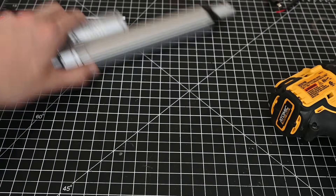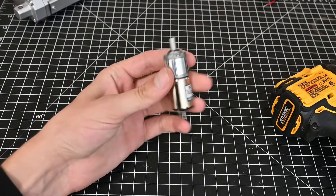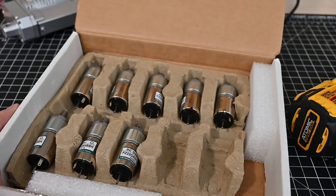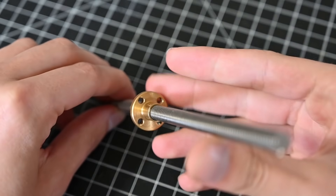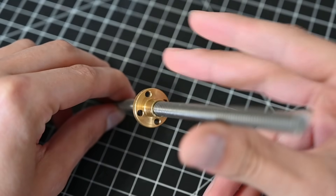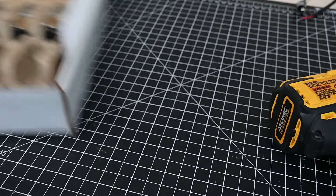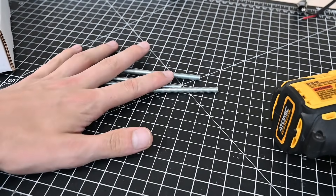Let's see if we can make a version that's mostly 3D printed. To power it, I'm going to use these 24-volt brush motors that already have a gearbox built into them — I got a pack of like 10 of these for pretty cheap. Ideally, for a linear actuator, you use a lead screw with a brass nut or even a ball screw to reduce friction. However, since we're going for cheap and easy, I'm just going to use a quarter-twenty bolt that I got from Home Depot.